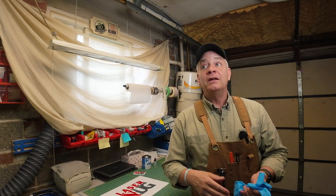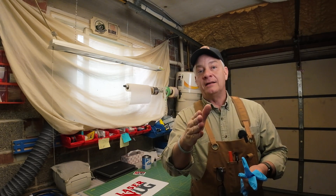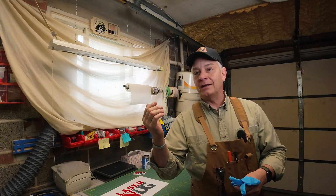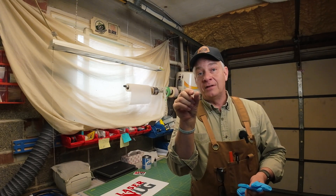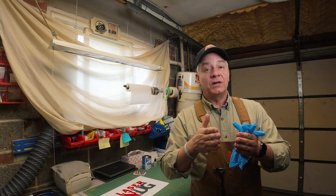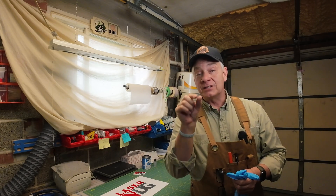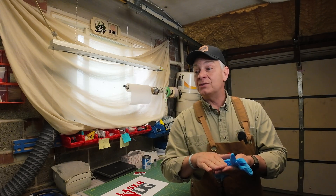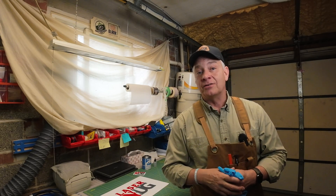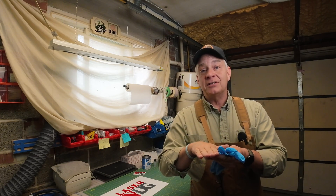GP, why didn't you use the offset kerf? Because simply, I didn't need to. For those of you that are not familiar with kerf — kerf is that amount of material that gets removed when you cut, whether it's through wood or acrylic or anything else. If you're using your table saw or your compound miter saw, the width of that blade is what they consider the kerf, and that of course changes the dimensions of what it is you're cutting. With the 1.5 inch lens, the kerf is so tiny that it's nominal, because the beam is so tiny. So you notice that when I slid those letters into their pocket, they fit like a glove. There was no need for me to calculate or include any type of offset kerf — they fit perfectly. There was no slosh, no extra room for them to move around. They sat down into the pocket nice and tight.